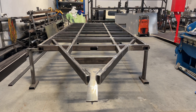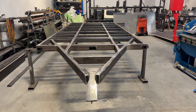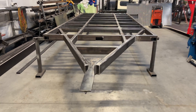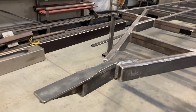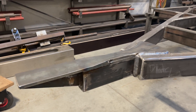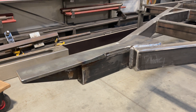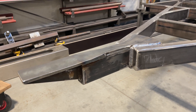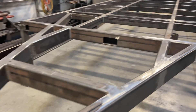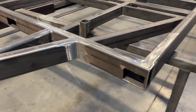We've lifted the trailer off the ground — as you can see, we've got it square and we've welded it up both sides. We've set the height of this trailer. We haven't put the adjustable tow hitch on here because this customer doesn't use it — he's had a number of trailers off us and this is what he wanted. We've completely finished all the welding on the top half of the trailer, including the addition of those gussets in the corner which we regularly put on.